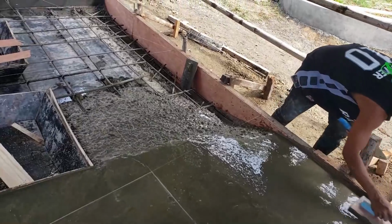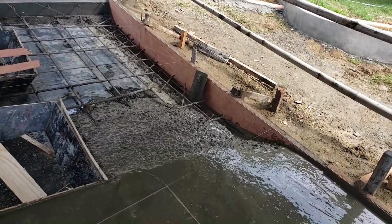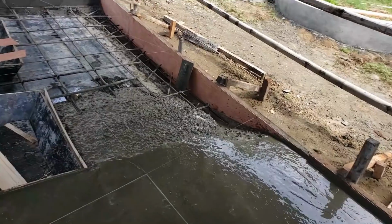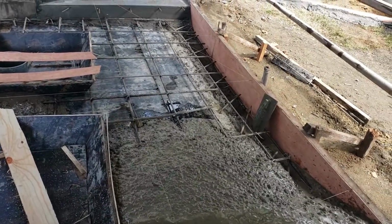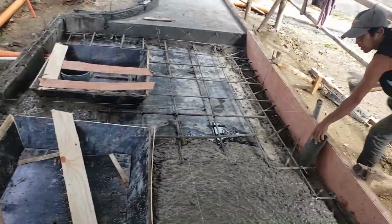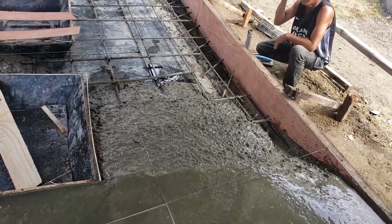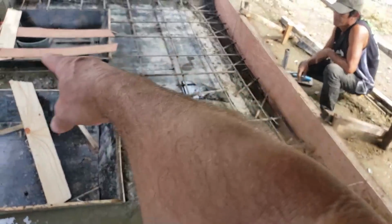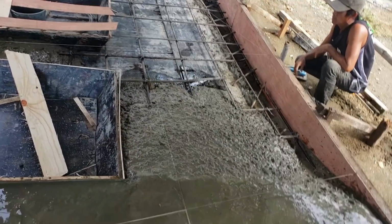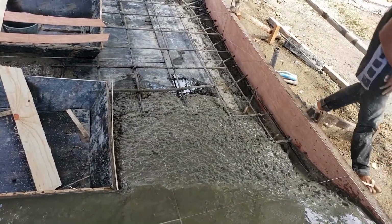It is coming along. And I know I'm doing this way beyond what most people would do. But it's that old saying: do it once and do it right. I see things here happen where this stuff breaks in. And I just want safety, security, and longevity. It's a choice to spend a little bit more on these important items and do it beyond what would be ordinary here. So through the middle, we put 16 mm bar both ways, and 12 mm on the rest of it, but in the most important place, where the huge load is through the middle, that's what it's got.